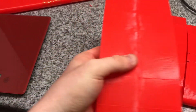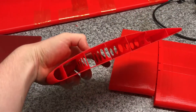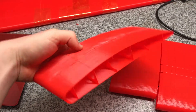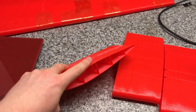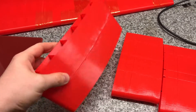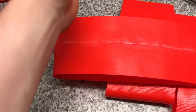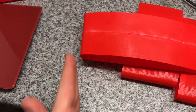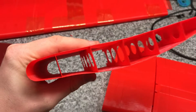These ones I experimented with bonding. Again, all single-layer walls. You can see the holes there for weight reduction, and these are super-glued together. For all intents and purposes, it is very strong. However, the lines — the ridges — go straight, not in line with the curve of the wing. So you get a lot of flex in this direction.